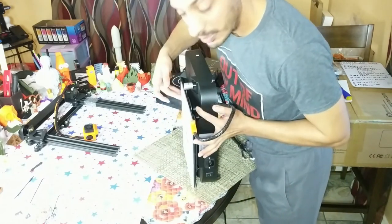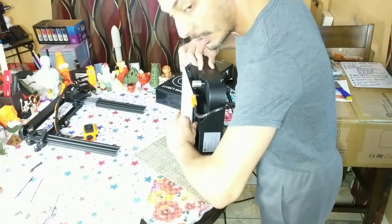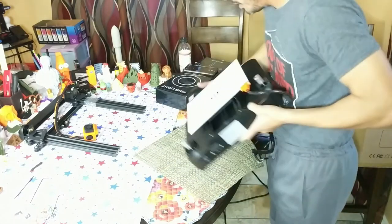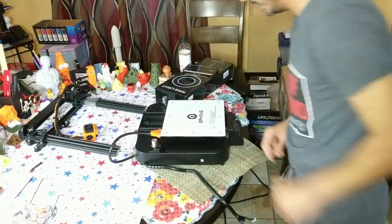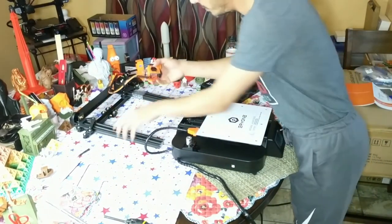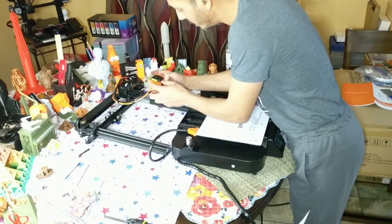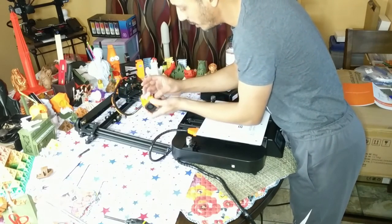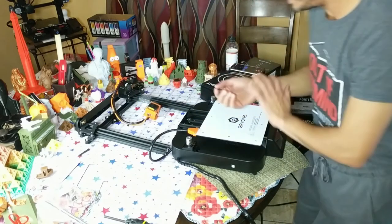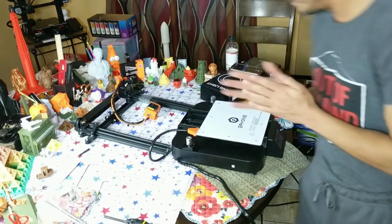This is really what you want. That's the whole point of those rollers. Make sure that the bed's moving, you know, without any hesitation. Looks good to me. All right. Just do the same things for the upper gantry system and everything. Make sure all these screws are nice and tight, including the wheel touch. Do not over tighten them and you should be fine. So I think we are ready for the assembly.